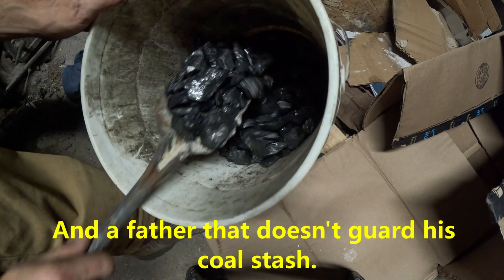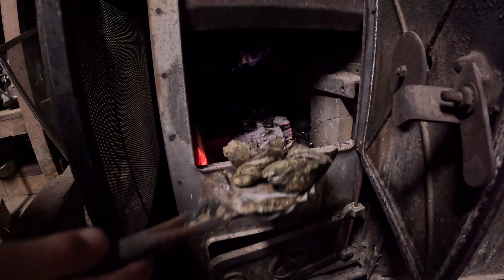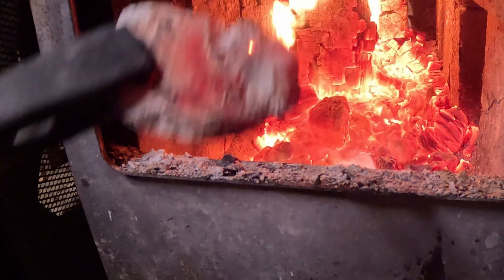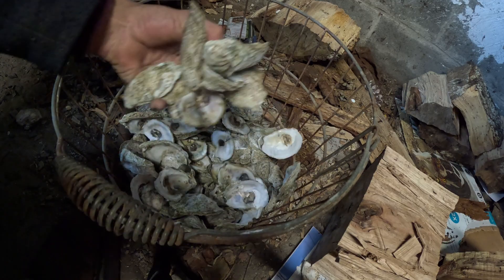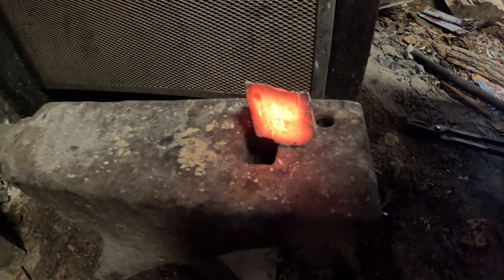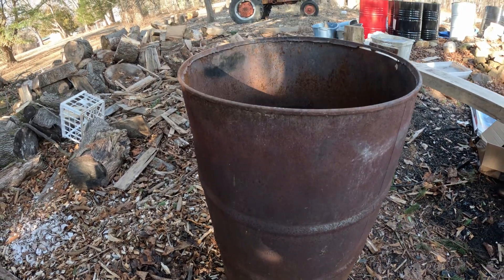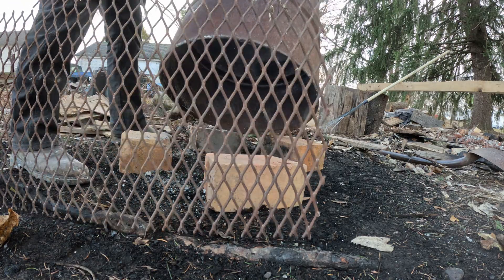I have a combination wood and coal stove, so I got the chance to try burning lime with coal for the first time this year. It did an exceptional job, but very fast. I prefer burning shells with wood. Limestone though seems to do well with coal. Unfortunately, burning more than three or four gallons of lime in a stove at a time is impractical for the average homeowner who just needs to patch a bit of plaster here and there or fill in a few mortar joints. A metal barrel with the ends cut out is something I use a lot for burning lime.